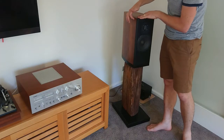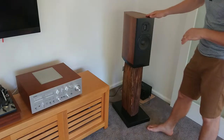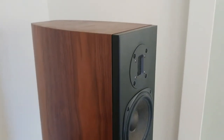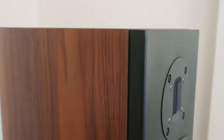In order to put on a veneer and not have any voids, and to have the veneer look nice and smooth, I had to do quite a bit of filling and then sanding back to try and get the finish really uniform. The other area I used a bit of filler was on all of the raw edges of the MDF.